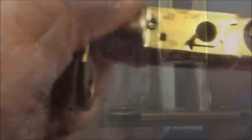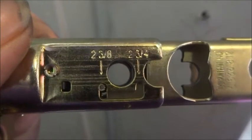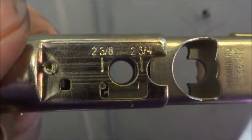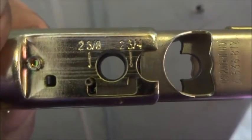Right here is the new inside of the door lock, so we're just going to put that in and I'll show you how to do that. Right before you put your lock in, you're going to want to make sure you have it on the right setting. As you see right here, there's 2-3/8 and 2-3/4. We're going to slide it over to the 2-3/4 section because the door is a little longer than most doors. I'll bring it back once we have that on the setting.